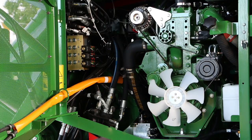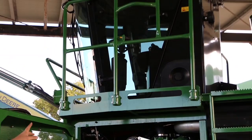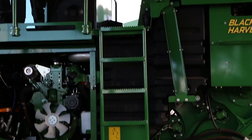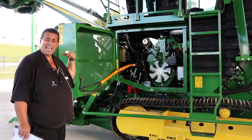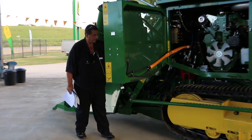The cab — we'll go through that later. One thing about the cab: very much like your fan housing up there, keep a clean cab. People that have dirty, dusty cabs — it will start affecting the air conditioning performance. It needs to be kept as dust-free as possible. That will keep your filters clean and your air conditioning will work at its optimum level.